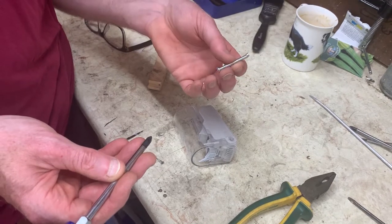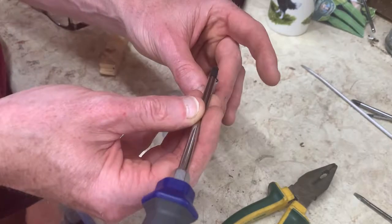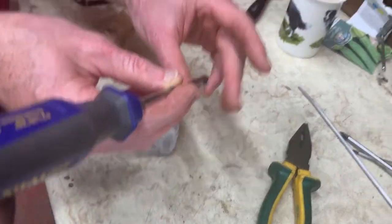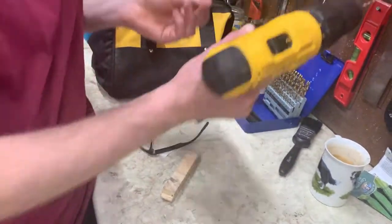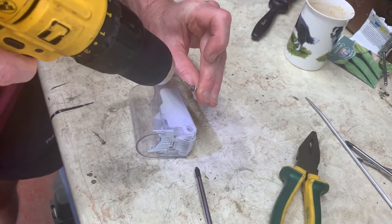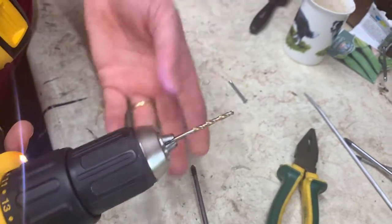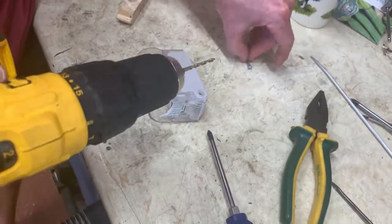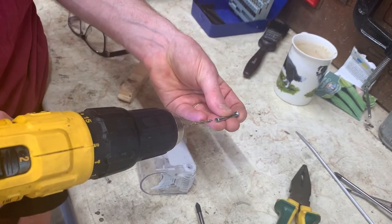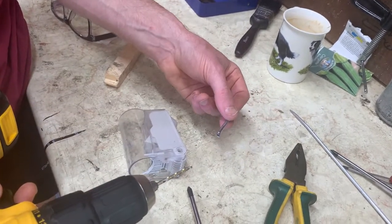So I should just explain how we drilled it. This is some kind of steel because it's magnetic, but it was really soft. All I did was, when it was in here, just try drilling it. This is a 3.3 to 3.5 millimeter drill — something around that size — so it just fits in. You're taking off the minimum amount of material, and you're trying to not make it spin. Dead easy.